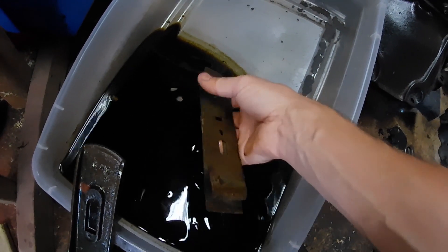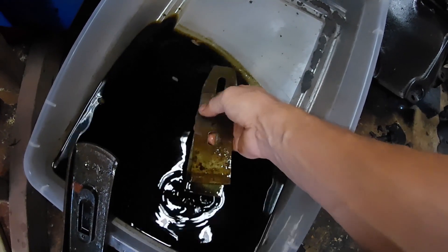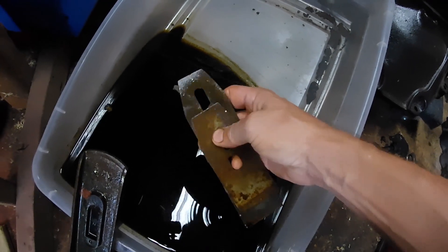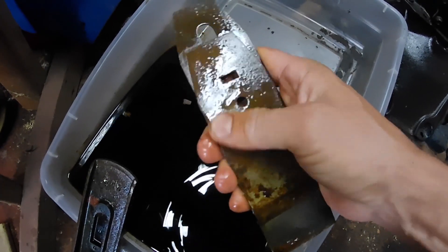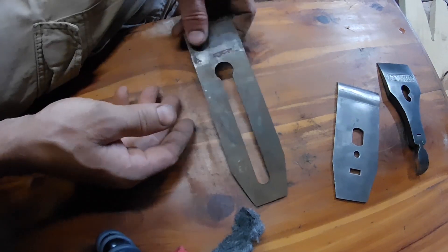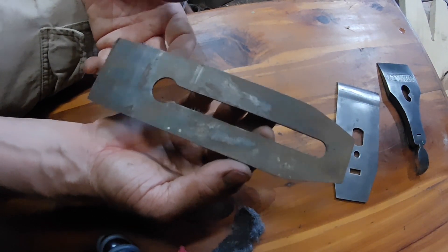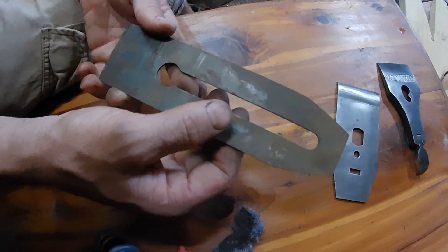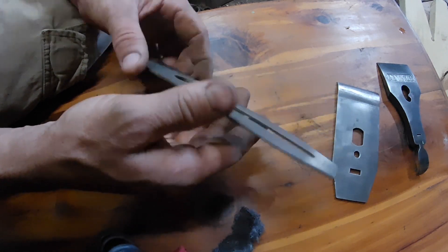This is always just the basic first thing I do. Most of this I will still take over to a wire wheel, but even now you can see how rusty it looks and just rubbing on it is getting a lot of that stuff off. This is what it looks like when it comes out of the Evapo-Rust and gets rinsed off — it still has like a little film over it. The Evapo-Rust I'm using is very dirty from the engine rebuild I've been doing.